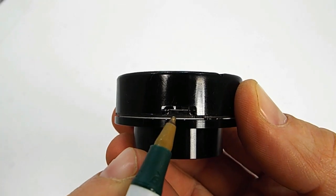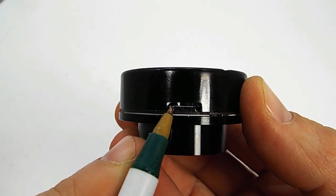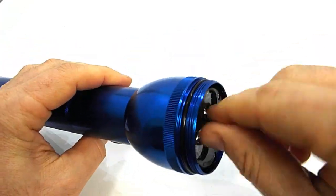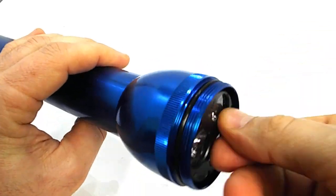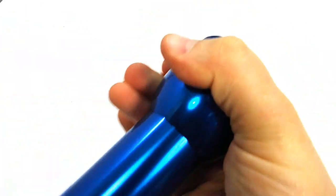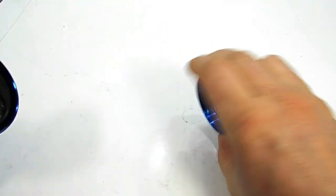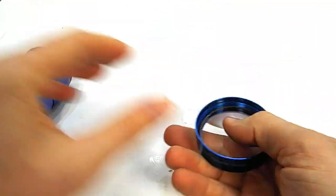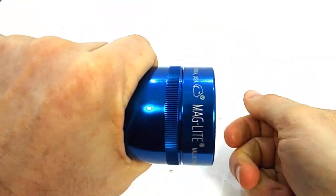The UI is changed by moving the small switch on the side one direction or the other. Peering through the optics, I can see what looks like three Generation 1 XML emitters. Install by threading onto the post of the bulb holder, then unscrewing the head till it reaches the base of the drop-in. You'll need to replace the factory O-ring under the lens with the thicker one provided. The Terralux is a fixed focus module with a medium beam profile. I'd call it a large hot spot with usable spill.